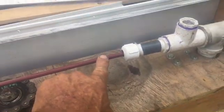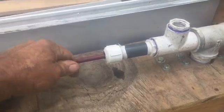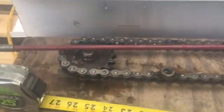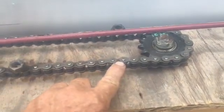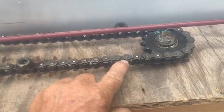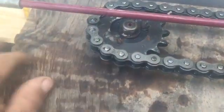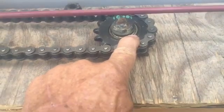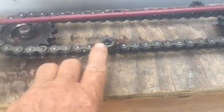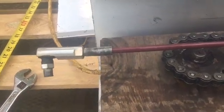Where you'd use a steel rod for a pump rod or sucker rod out the top for the hand pump to keep it stiff, we just put another section of fiberglass rod on it and bring it up. I used number 50 link chain — I can get this stuff at a local place, the Surplus Center catalog, and DIY-type suppliers. This is a 50-link 16-tooth sprocket, and this is just one with an idler pulley that holds the bottom end of it. We welded this thing — you can also get these at Surplus Center or off the front end of a riding lawnmower.